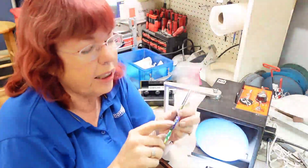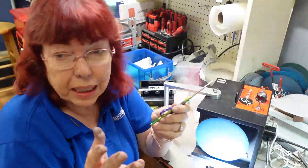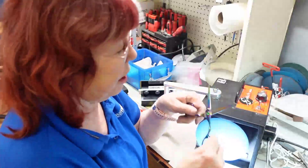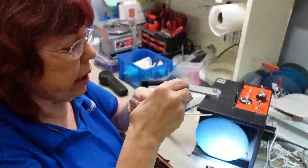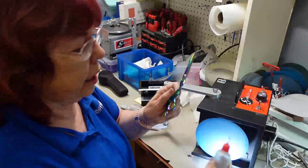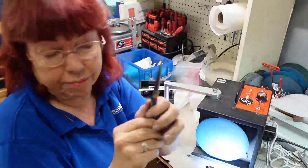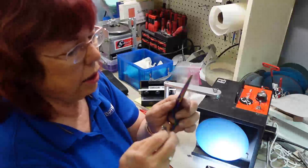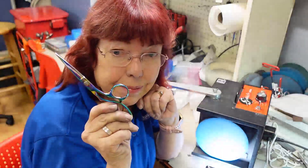It's not pulling at all. Special thanks to Josh for putting these together. All these parts — little screw-in bumpers, pull-through bumpers, all of these parts — we sell them on our website and we use grandchildren to count them out and put them in little bags to make it easier. The only thing left to do is oil it — just put a little oil right here where metal rubs against metal. Always after you oil it, double-check the adjustment. See how that loosened up? Go one more click. And that's it — Icon shear done.